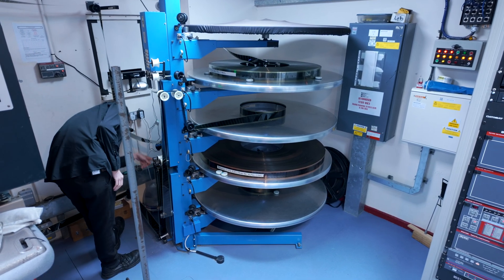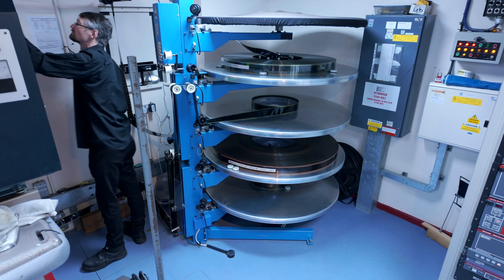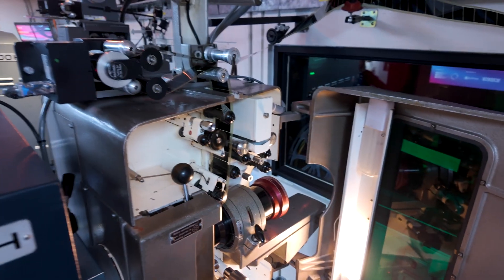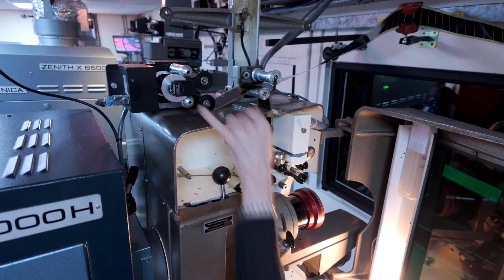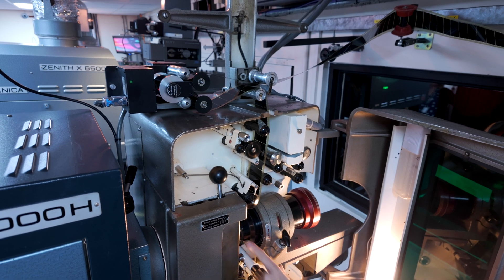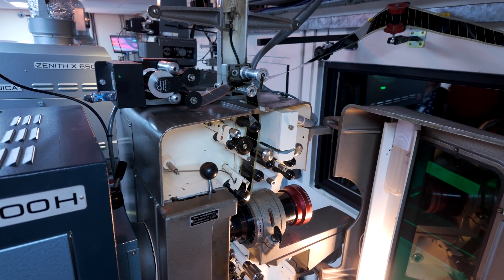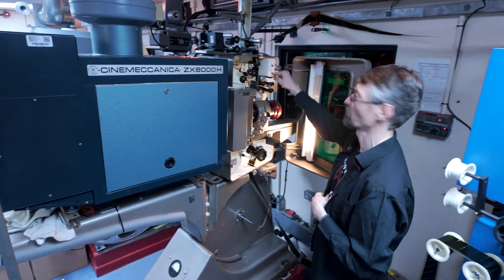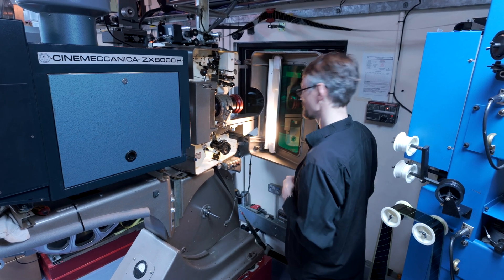We have one last check before we run it. This film has a digital soundtrack, which means it goes through this sound reader. If the film has an analog soundtrack, it goes through a different sound reader. The worst thing you can do is put it through both at the same time, because then the number of frames between the picture head and the gate will be wrong and the sound will go out of synchronization. You should always be either one or the other — never the two film paths should meet.